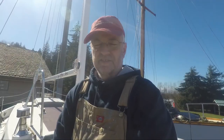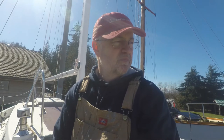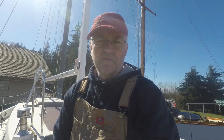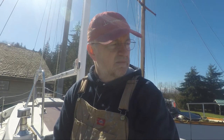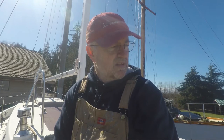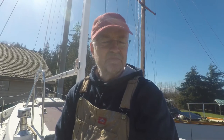So, as usual, it's moi. I'm here working on the bowsprit platform. But today I'm going to take the platform back off, I'm going to mark it for thickened epoxy for the bracket. And I'm going to put some straight epoxy on the places that I ground off, and if things work well, I'm going to assemble it. I'm going to put it all together. So, here's hoping.